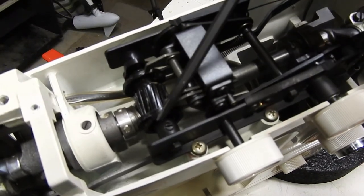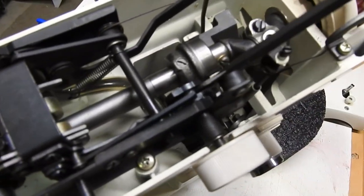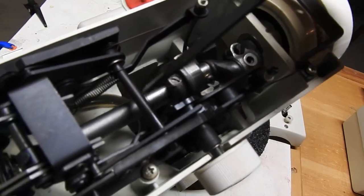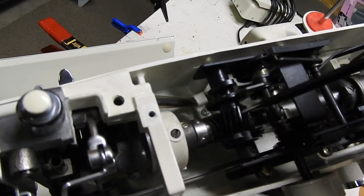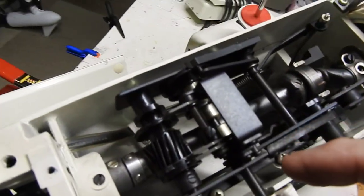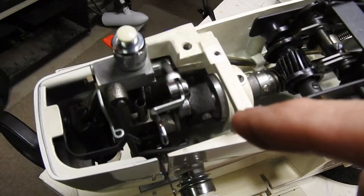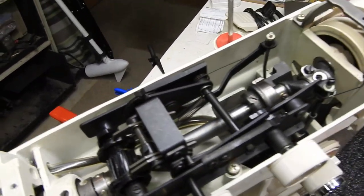Right away as soon as I took the top off — that's a plastic gear with a metal worm gear on the main drive. This little cam here for the zigzag stitch is plastic too, so there's obviously some plastic here. That doesn't look worn too bad at all. But she is seized, so I'm going to have to get oil all throughout here.